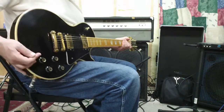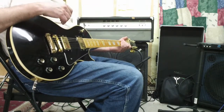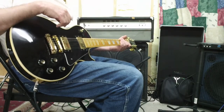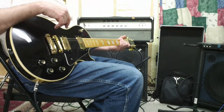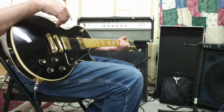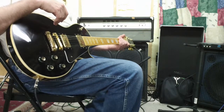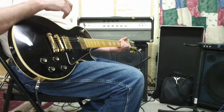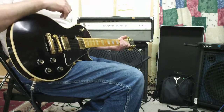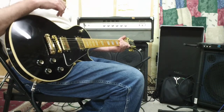The owner of the forum is the one who presented this. He has a VT22 and doesn't like ceramic caps, so he replaced all the ceramic caps in his amp. He came to the tone stack — it's a modular unit with seven pins, almost looks like it's been vacuum-formed, encasing four capacitors and two resistors. He preferred to replace that with individual components, and a few other readers have done it too and said it made a difference in their sound — not so much changing the amp as clarifying the tone controls.